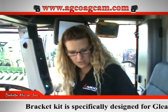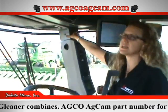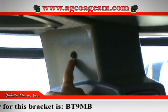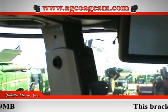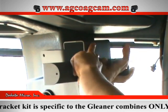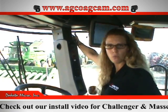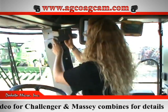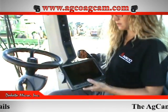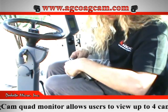If you want to view it on the AGCAM 9-inch quad monitor, you're going to need this bracket. It's the one that will attach here to this side post. To attach it to the side post, you remove this Phillips head screw right here — it's a 7/32nds screw. Take it out and dry-fit the bracket up here. Once you've got it lined up with that screw hole, take a pencil and mark this side, then take it off. With a 7/32nds drill bit, go ahead and make a hole where you marked it. Then put this back up and mount the bracket. Once the bracket's up, you can go ahead and put your monitor on — it comes with a couple of wing bolts.